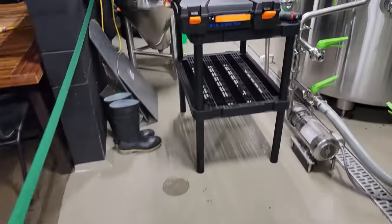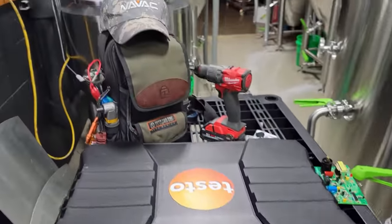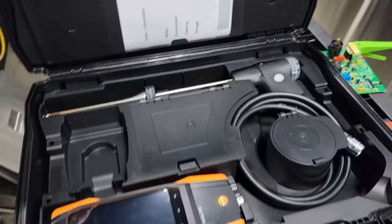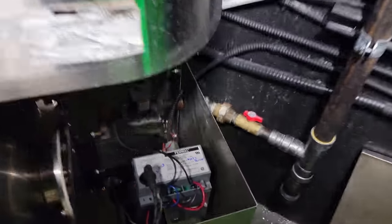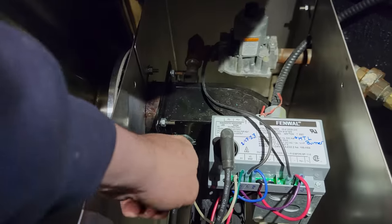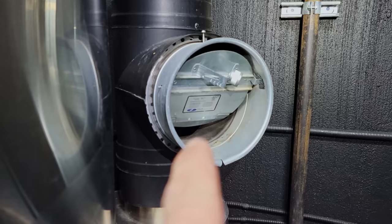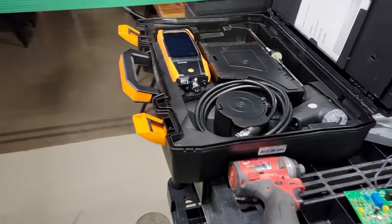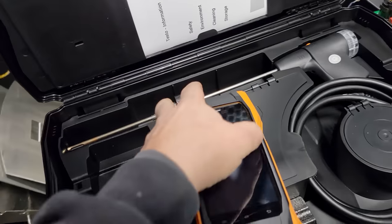So what we're doing today is we're going to double check it with the Testo 300 here and give it an old test over. This had a control module that got burned up, so they got that redone. It's running right now — melted out some plugs, had to use a washer to make a plug. Can't get half this crap from the supplier. We're also going to be checking our draft on that, which is built right into the Testo 300, which is pretty sweet. You don't need a separate gauge for it.